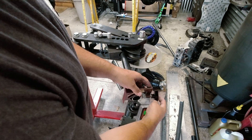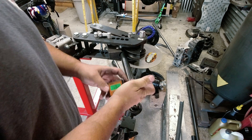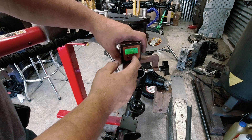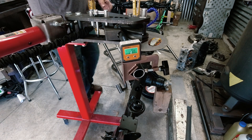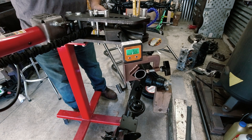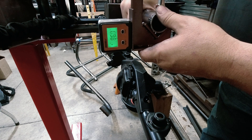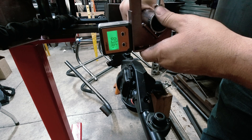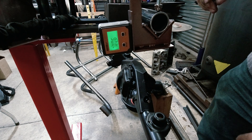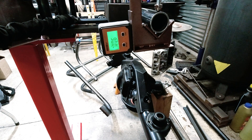So if I have to clock this tube later, I can put this on — it doesn't really matter where — I can just set this on there, zero it, and then when the bend is done, if I need this to be at 90 degrees or something other than that, just rotate it until it's at 90 and then lock your tube down and make your next bend. And if you put this at the end of your pipe, you can make all your bends and it would track — you don't have to keep taking this on and off.